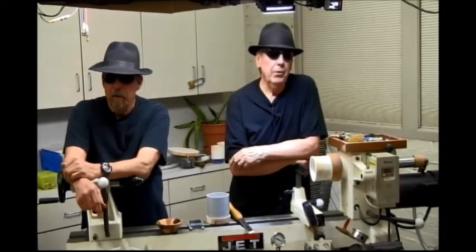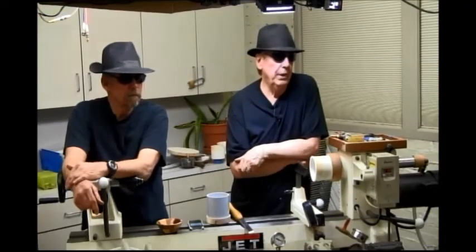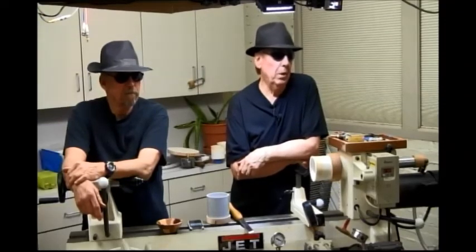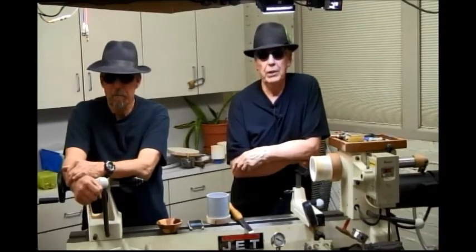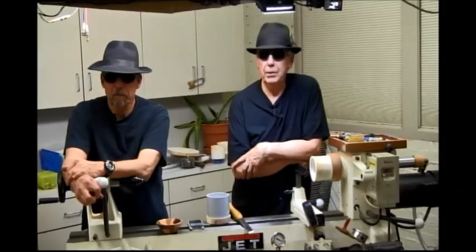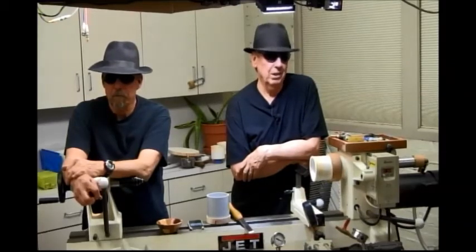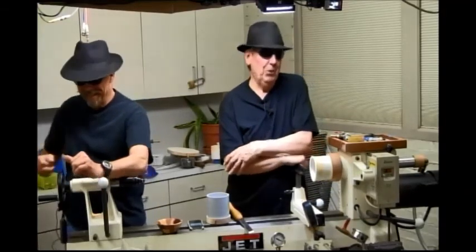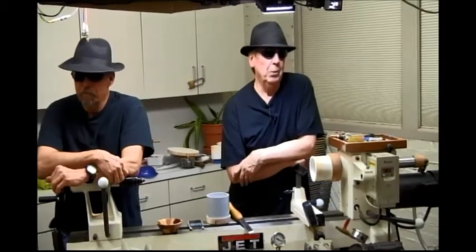The other thing, if you're looking for pumps on eBay, and I've spent an exorbitant amount of time looking at pumps on eBay, be careful, because there's a lot of pumps on eBay that say they're 50 cycle pumps. They're made for Europe. They don't run on 60 cycles here in the States. So make sure that the voltage and the frequency of those pumps are what you're looking at. Don't make the mistake of buying a 50-cycle pump and trying to use it on 60 cycles, because it will not work, and you'll damage the pump. But if you do, just put it right back on eBay. You can hope somebody else will buy it. But there are a lot of pumps on eBay that are 50-cycle pumps, so be careful if you're buying one.